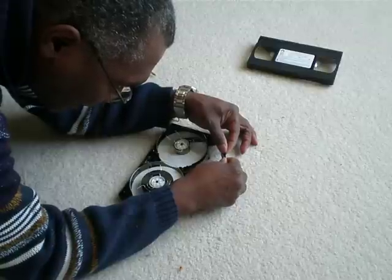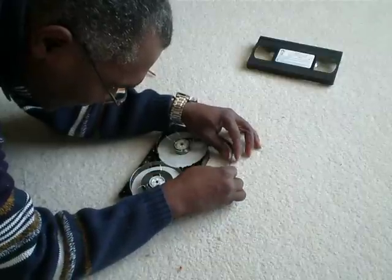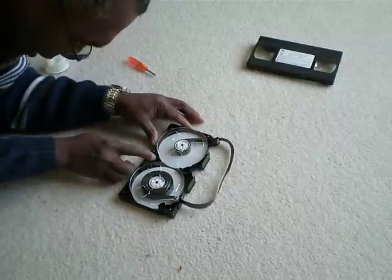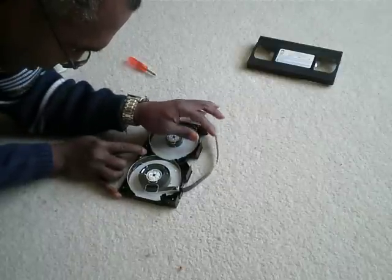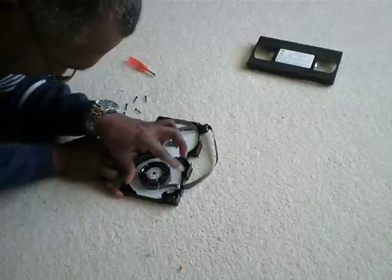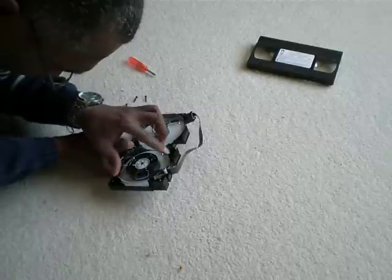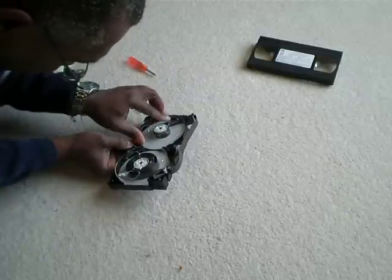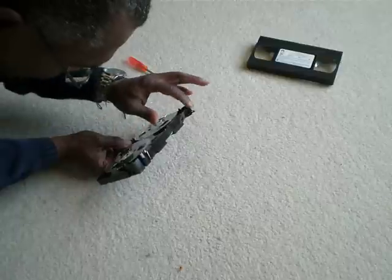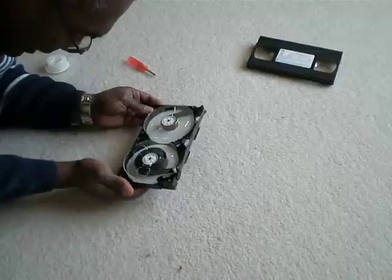Overlap the two halves of the tapes and put them together. Again, press this lever here, take up the slack. There's the splice right there. Okay, so I tighten the tape. So there's the splice tape.